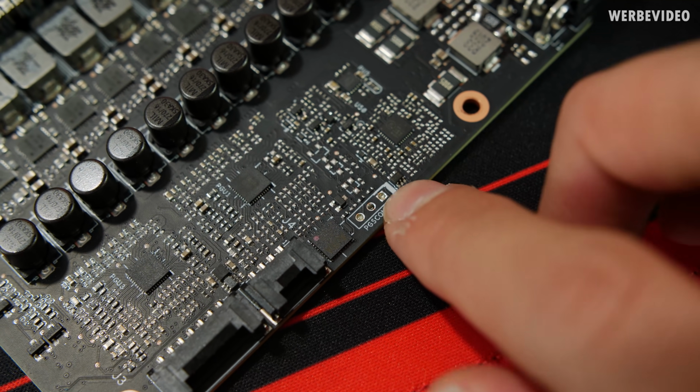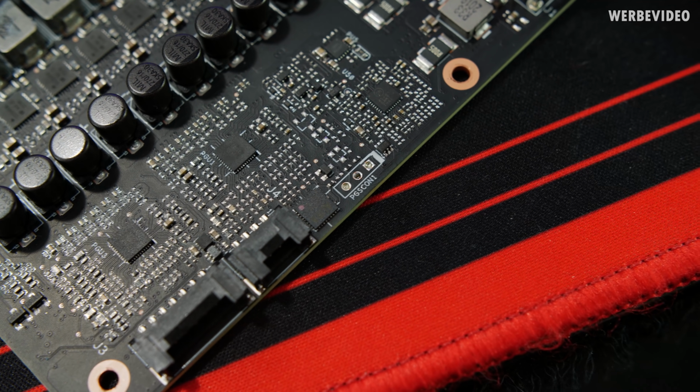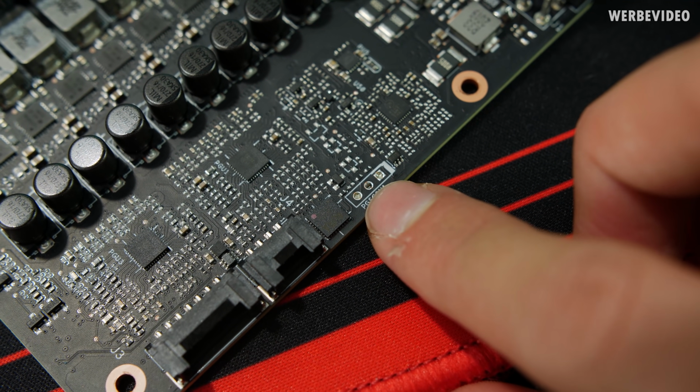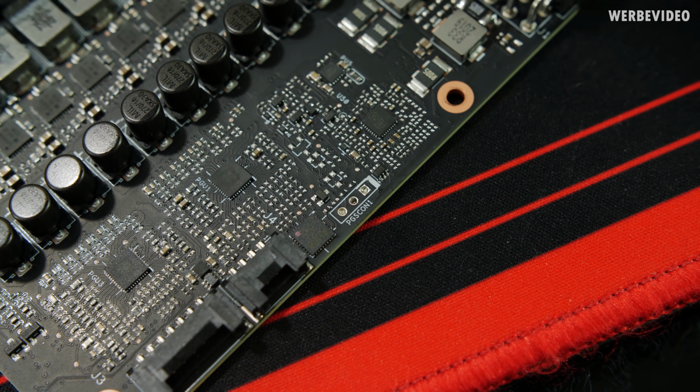One thing I have to correct is the connector. First I thought that the top part would be ground and the bottom 2 should be SCL and SDA for the I2C bus, but then figured out that the middle one is ground and the outer ones are SCL and SDA. Just switched them around and now it's working.